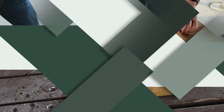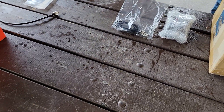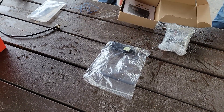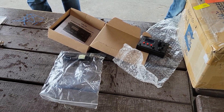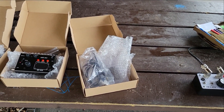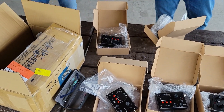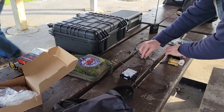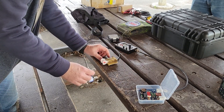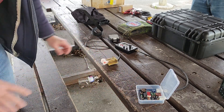Let's take a look — here they are: the radio, the included accessories, and slimline documentation. First: dummy load — always the dummy load first. I've learned. On 40 meters it's doing 3.99 watts, and it's even warming up the dummy load a little bit.